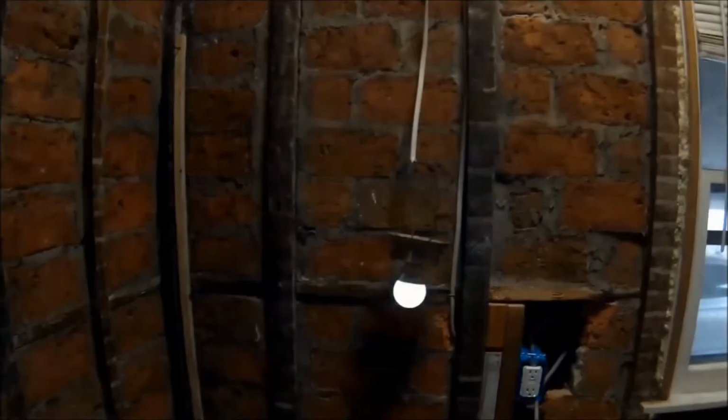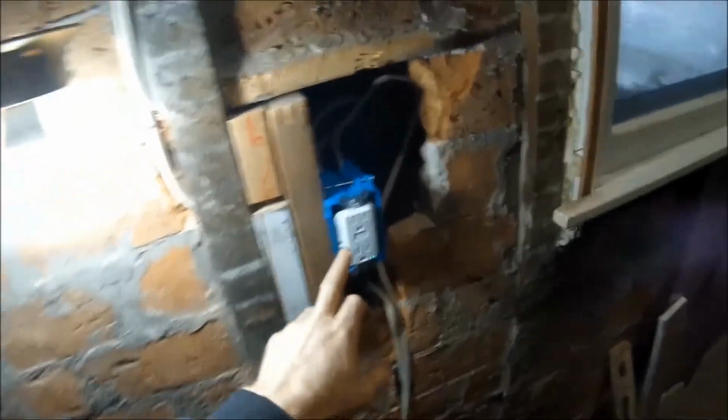The exhaust is the top one for the fan. And then the light in the middle, and that one has a speaker so you can listen to music from Bluetooth. And the bottom one is this mirror switch. It'll be for the mirror. I put a GFCI right here and a GFCI down here. I did leave an electrical outlet junction box in the center. I need to mark out where it is. Now I've just got to do my plumbing, and I got to figure out where I want my toilet at